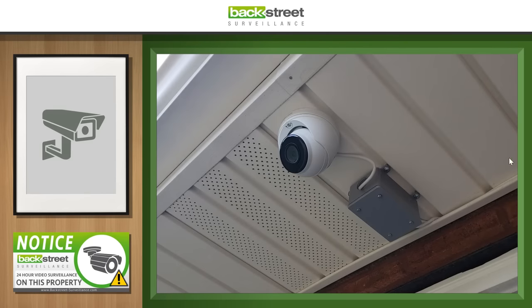They brought the cable along and tucked it up under the soffit — that's fine — then into this box where the pigtail from the camera connects. They get points for protecting it from weather and tampering. But this could have been much easier: eliminate the box, run the cable up this siding groove, drill a one-inch hole, connect the camera, push all the cable into the hollow space, and mount the camera over the hole. All you'd see is the camera and a clean cable run down to the gutter. It'll perform the same, so let's give this one a B.